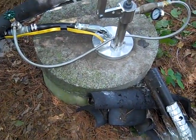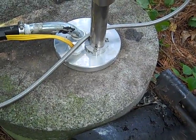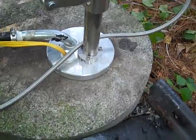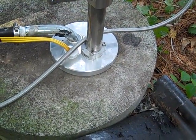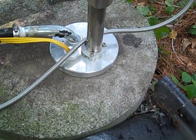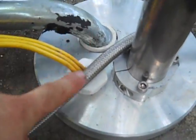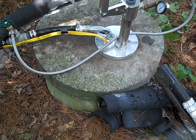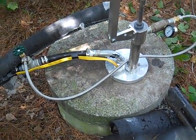Yes, you can put a Simple Pump on a bored well. The key is having the cap be able to connect to something — preferably a piece of well casing. You could cast your own lid with a piece of casing in it, and then hang a submersible pump from this cap right here. So the submersible pump is here, your wiring is here, and the Simple Pump is here.